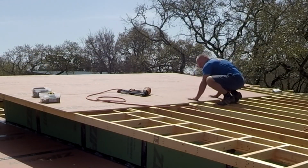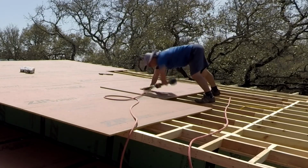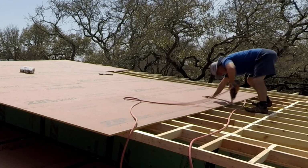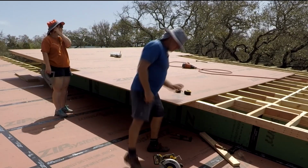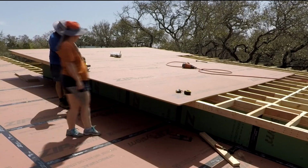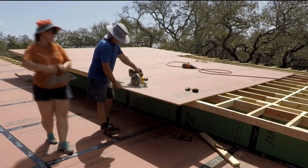And here you see me putting the panels on. I go to the bottom side, put them in place, put 1 or 2 nails in the bottom section, and then finish nail all of them. So pretty straightforward. Angie came out to help. I'm gonna trim some of this off. She's gonna mark where the overhang 2x are, so I can nail those.